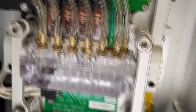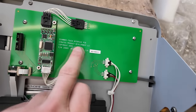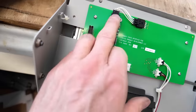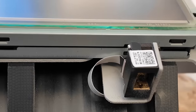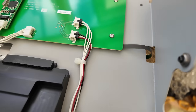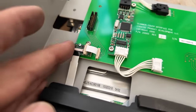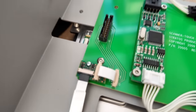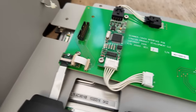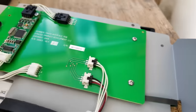We'll take all this apart and see what that looks like. So this is the back of the screen — nothing too exciting, just an interconnect board. Incidentally, all the boards in here have got 'Stratos Product Development LLC' on them — a subcontract design house they contracted for all the electronic design. This is the touchscreen controller, there's a touchscreen cable and a little downward-facing barcode scanner — that probably explains the laser warning symbol. The touchscreen cable goes to an FFC connector on the underside of the PCB, so you have to take the whole PCB out to unplug the touchscreen.